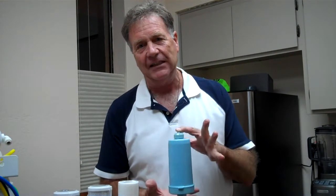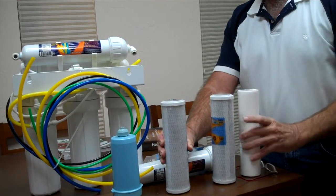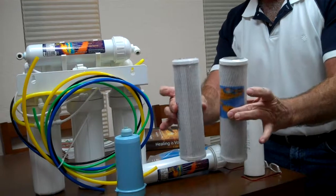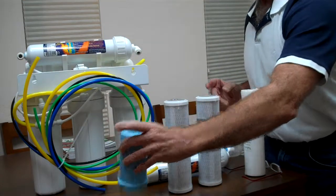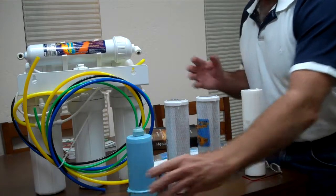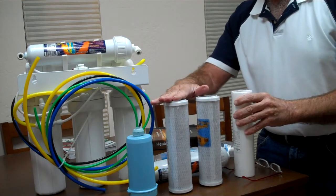Now, we're going to talk about the purity of the water. Remember, we were talking 500 TDS, not in compliance. What does the plate technology use to clean the water? It uses a filter this size. When it comes to cleaning water, contact time is everything. In our technology, here's what we use. We come in through a sediment filter. That takes out the big chunks. And then we have 2 carbon filters. This takes out the chlorine, the fluoride, those types of things. That's what this is designed to do. As you can see, on the unit that we used over there, we had 0 reduction in TDS. Sediments and carbon do nothing to reduce TDS.